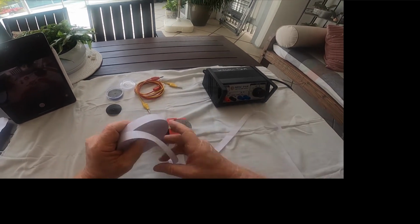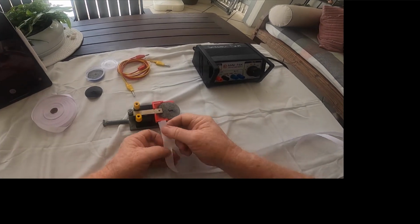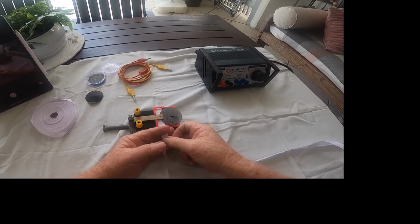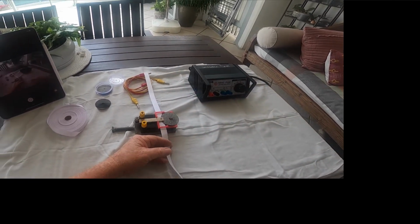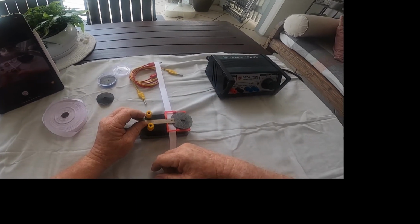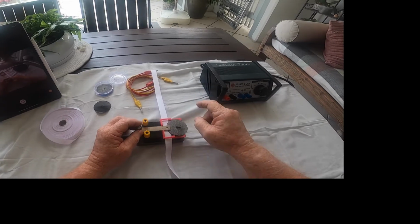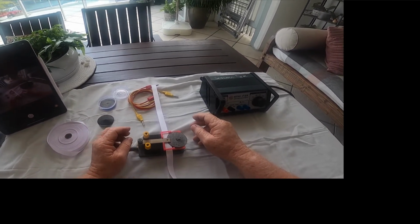We'll take some paper, only just enough to demonstrate, and then it's got to go through under there, and then it has to go underneath the carbon paper and poke out the other side. These red guides make sure that it always goes through straight. Here we have the adjusting screw, which allows it to be free to move like this, or tightens it up so it's a lot springier. There'll be some settings where it works well, some it doesn't. You may have to play around with that.